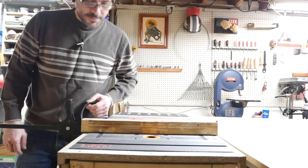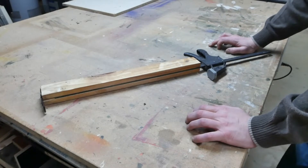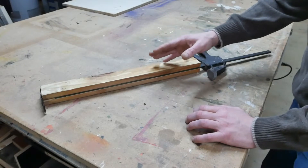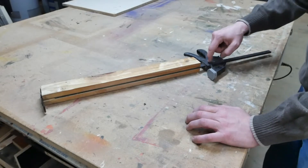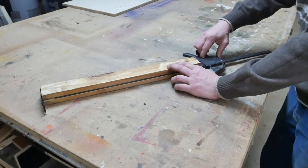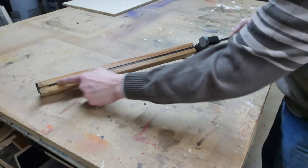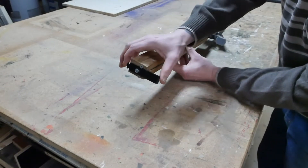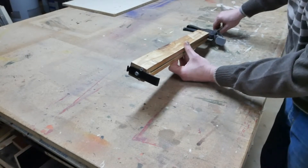Let me show you the fence. The fence that came with the table saw wasn't great. Whenever I put it on the table saw and did work it would creep from side to side because the clamp wasn't hard enough. So what I did was — this is the guts of a regular Harbor Freight clamp. I routed the inside of a piece of 2x4 so this fit in snugly. I attached the end of the fence that I had — I used that piece. But you could use any piece of metal with a curve at the end. That would work too.